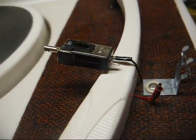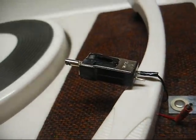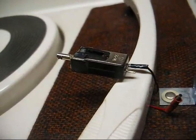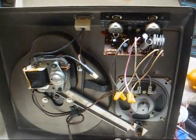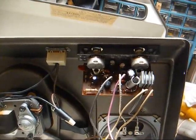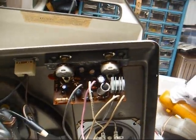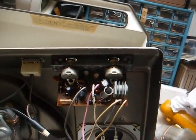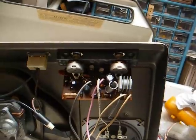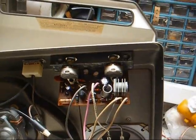I'm not getting a click when I rub my finger across it, but I'm getting a buzz. Since the cartridge has output and we're getting a buzz, that tells us that our ground lead must have an open in it. Here's the underside, and there's the amplifier. I've replaced the capacitors and some of the resistors I had to manufacture by putting two in series. It seems like these solid-state rigs always have oddball value resistors that are not common in tube sets, and what I usually keep on hand is basically for tube sets.